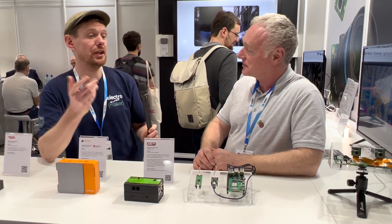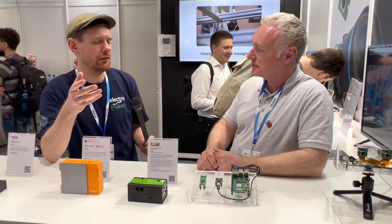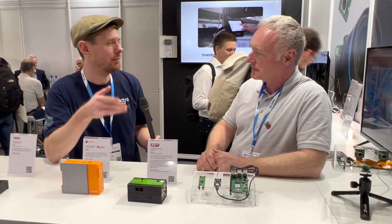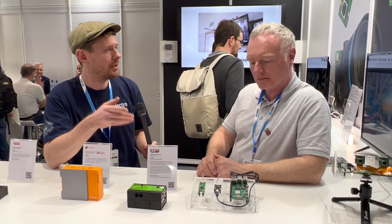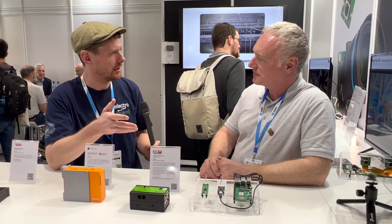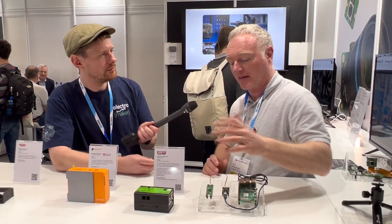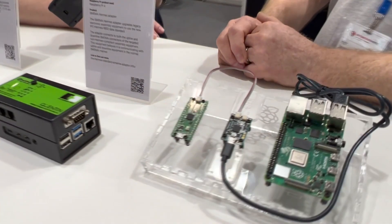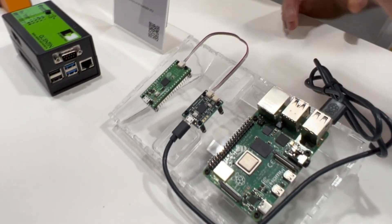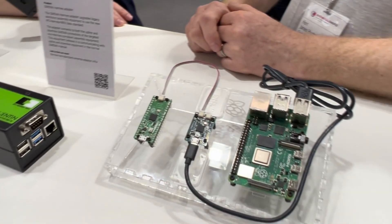One other question that's occurred to me is that some people have the impression, since it's called the Pico Debug Probe, that this is designed purely for debugging Raspberry Pi Picos. But it is a general-purpose debugger — it can be used in a variety of settings. The wire you see here is an SWD wire — Serial Wire Debug — which is a standard ARM protocol, so it should work on any other ARM-based devices with an SWD port on them.